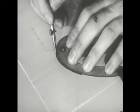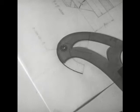Non-circular, visible curved lines follow auxiliary lines with the compasses and are drawn with the ruling pen and the irregular curve. Note how the curve is reversed so that the halves of the curve will be symmetrical.